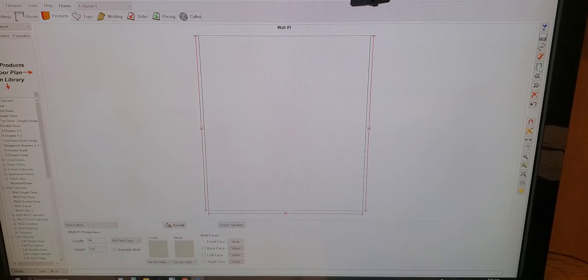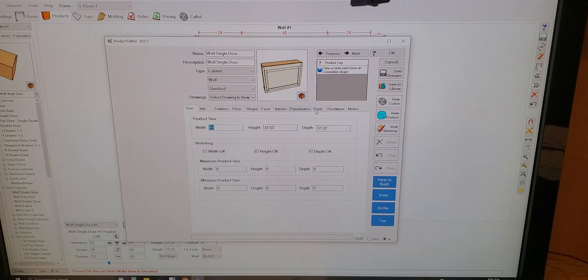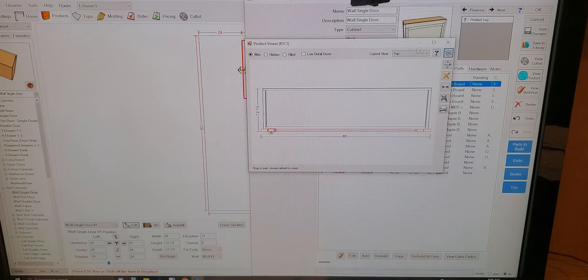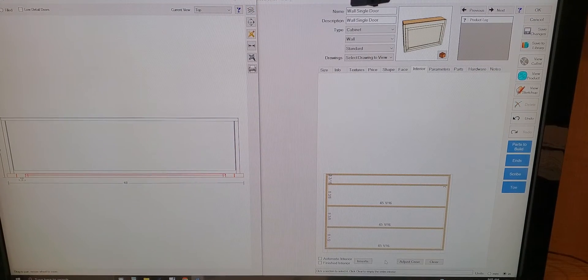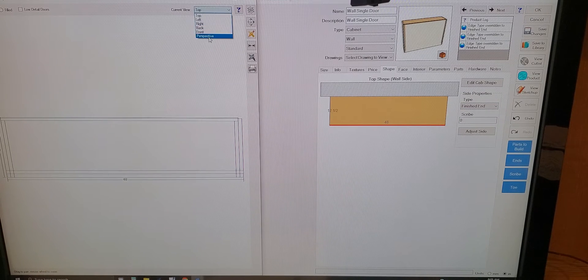I'm going to draw a wall — it's arbitrary — go to my products, the front view of the wall, and I'm just going to select a wall cabinet to go on here. I'm going to make it — I like my hoods to be six feet off the floor, so we're going to go 33 and a half. I'm going to make the width 48, centered in the room. I modify all my bottoms so I'm just going to reset that all the way. Go to the interior, clear that out. Go to the shape tab, I'm going to make this a finished end, make the right end a finished end, and make the face of it a finished end as well.